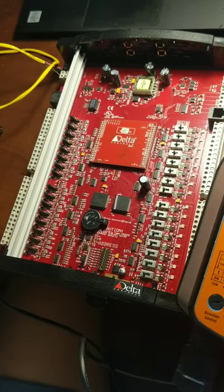Another thing: for the feedback wire, make sure it's not shorted. If it's shorted it will give you the weirdest readings. Make sure it's not accidentally put to ground. You can see here the indicator is moving to zero.